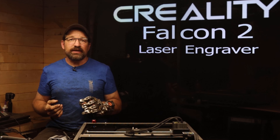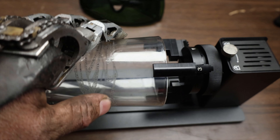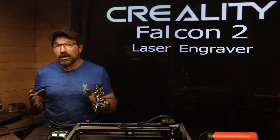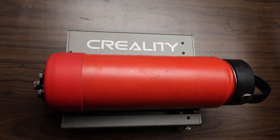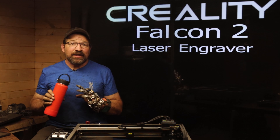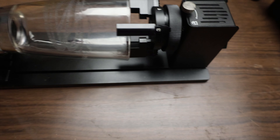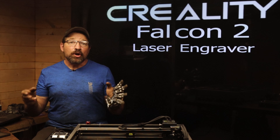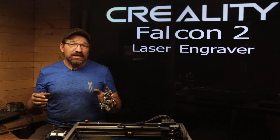It's a pretty easy way of getting into making custom signage and merch. Depending upon the outside profile of the cylindrical products you're likely to be engraving, you may want to opt for the three-jaw chuck pro version of the rotary attachment over the two roller contact roller attachment. If you'll be primarily engraving cylindrical objects that don't have a taper to them, the two roller contact rotary might be the best fit. The setup with that accessory is super simple — no need to mirror or scale the Y-axis of your artwork. With the three-jaw pro rotary attachment, you'll need to mirror and scale the Y-axis relative to the diameter of the object you're engraving. It's a little more setup, but on tapered items, it's really the one to get.